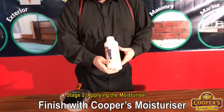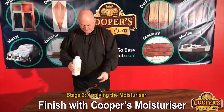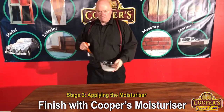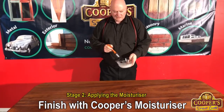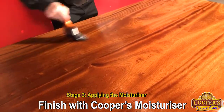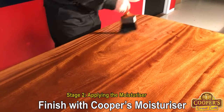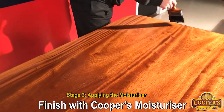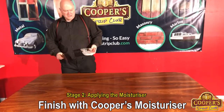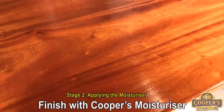What we've done is partially sealed the timber with the semi-sealer and it makes a better glow for the moisturiser. So this is our moisturiser — put some in the bowl. Moisturiser is non-toxic, so you can use it on chopping blocks, on bowls, on anything where food might come in contact. Not particularly tasty, but it is non-toxic. This table is going to drink it up. We want to just let the wood absorb what it wants. Keep an eye on the wet reflection.